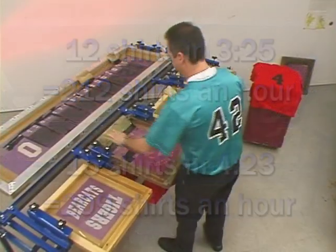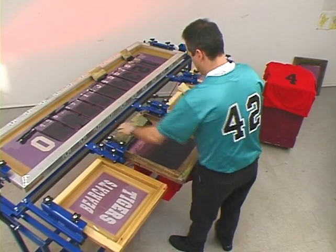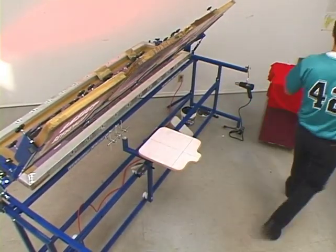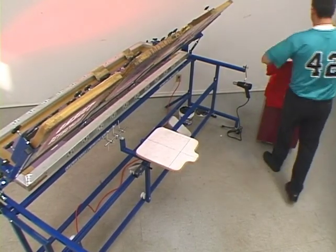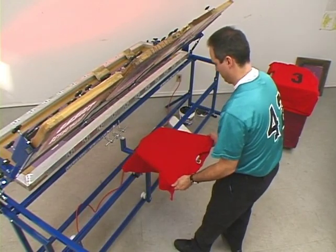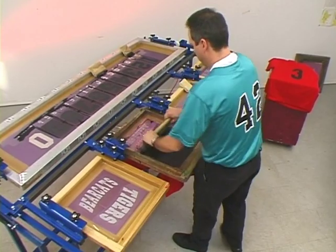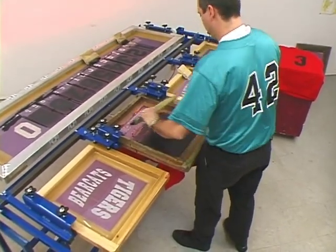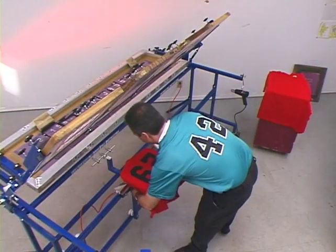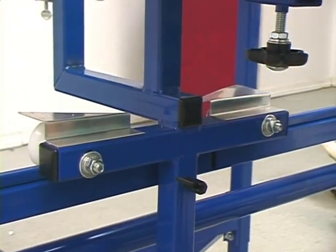The machine also has a 4-color attachment so the front logo and the numbers can be done on the same machine. To use the attachment, you just remove the top screen and bolt on the 3 arm attachments. This attachment will also enable you to print one color numbers and the sponsors or the individual names at the same time. To line up the shirt in the correct position, the spring-loaded plunger pin must be engaged to the proper location.